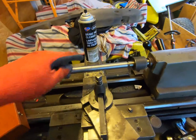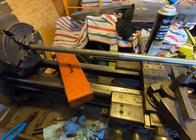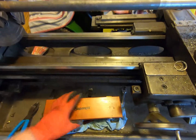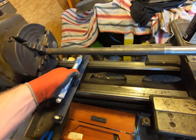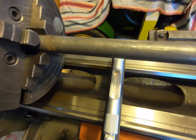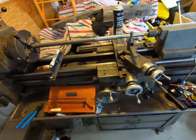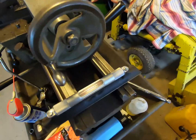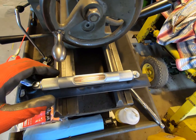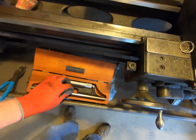It does work — you can actually see that we've done some machining; not very good machining, but we have done some. I don't even know what kind of steel that is, I just know it was steel I had for setup. I picked up a 12-inch Starrett machinist level. To level the ways you basically just put it across like this and check for level. It should be level longitudinally as well, but it is not — I'll have to fix that later. It is level on both ends though; each graduation is 0.005 inches per foot.